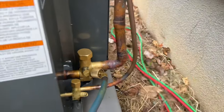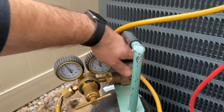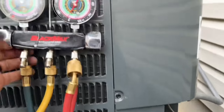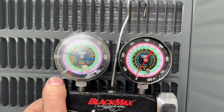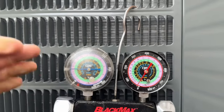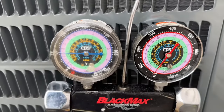We've done a visual inspection and made sure that all of our brazed joints are perfectly solid from a visual standpoint, but we're going to pressure test with nitrogen. We're going to make sure both of these are closed, open our nitrogen — we've got plenty of PSI in our tank. We just have the blue side hooked up to the suction port because we have no Schrader valve there. One tip: don't go ahead and put 400 PSI in there right away — put about 50, let it sit, and if you have a major leak that will not waste a ton of nitrogen. Don't ask me how I know. So we're at 50, we're going to let that sit for a few minutes and then crank it up to about 400 and let it sit for about 10 minutes.